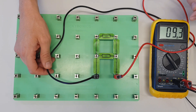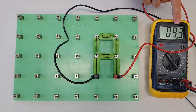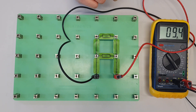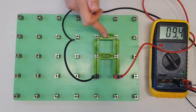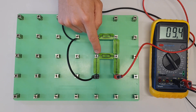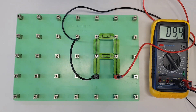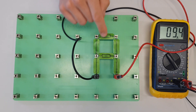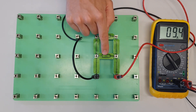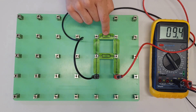Now that may at first seem a little bit confusing. Why are we getting a smaller resistance than either one of those resistors? The answer is that when we connect them in parallel, we've created an additional path for electricity to flow. If you imagine this was like water in a pipe, we've introduced a new branch where water can flow through — meaning more water can flow, which means there is less opposition to that flow. So the total resistance of this circuit is going to be smaller. We've got two resistors of the same value — 18 and 18 — and the total resistance is 9 ohms, which is simply half of one of the resistor values.